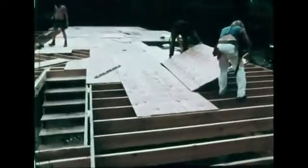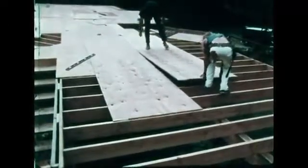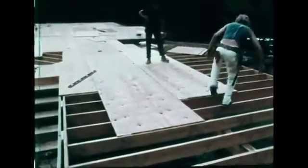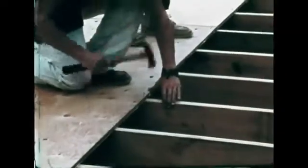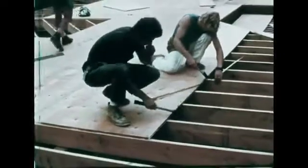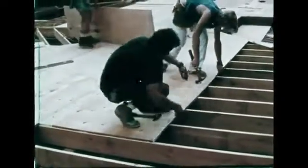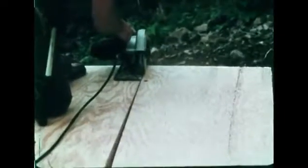For greatest strength, the long edge of the plywood is placed perpendicular to the floor joists, and the rows, called courses, are staggered. The joists, spaced 16 inches apart, accommodate the 8-foot length of the plywood. 12 or 24-inch spacing would also allow the end of the plywood to land directly over a joist. Excess subflooring is trimmed off.